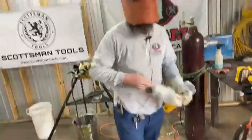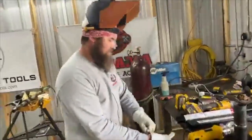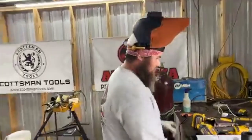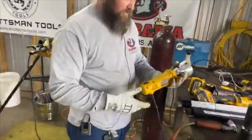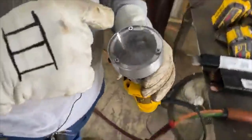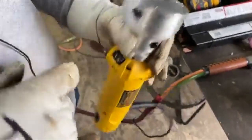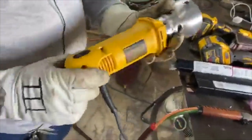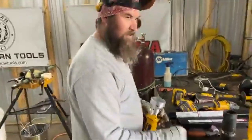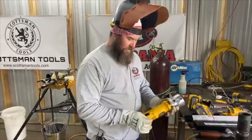What are you doing? All right. So in the school, all our students have one of these grinders — Dewalt Tungsten Sharpener. The reason we make them use these is the diamond wheel in there lasts about six months. It'll last them all the way through school. They don't have to keep changing in and out. It's heavy duty. They can't burn it up. It's something that's going to last them through school and later on, and it works fast.